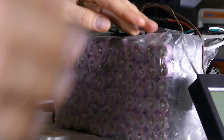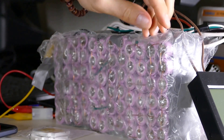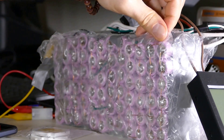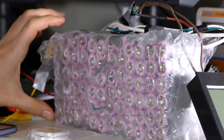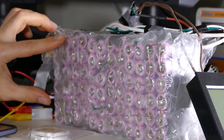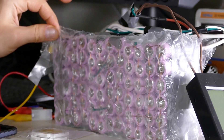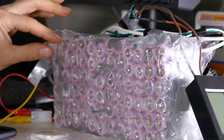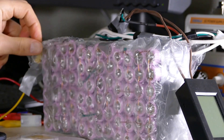Here is the main pack — this is a 24 volt, roughly 20 to 24 amp hour pack. I had one pack made from old laptop batteries, so I removed that and spot welded a new pack from these Samsung batteries to match the rest of them.